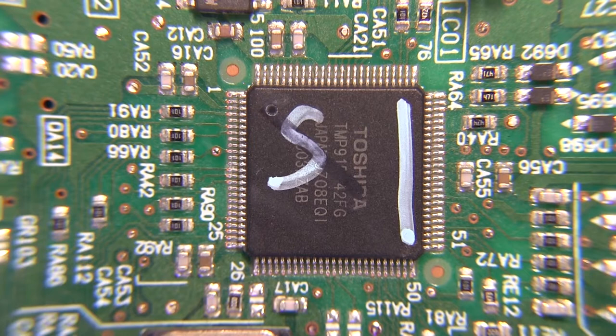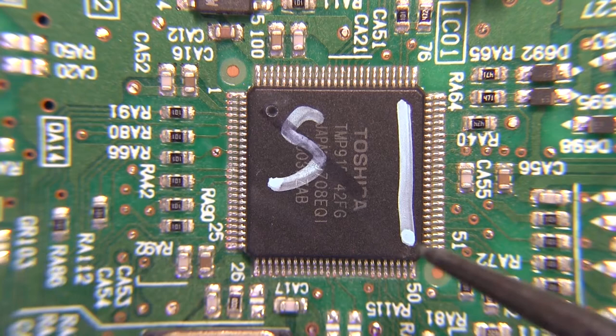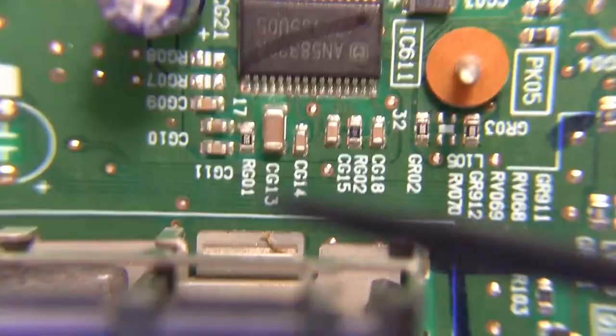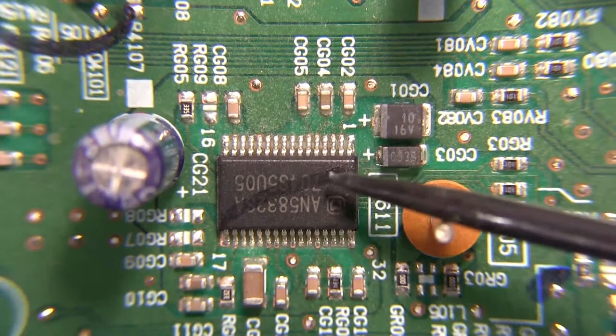I have a feeling it's probably also doing some of the on-screen controls, like for the menus — it might be generated by this. I'm not entirely sure how it's all put together. Moving over here, we've got this chip right here — this is an AN5832SA. I couldn't really find a specific name for it; it just says it's a silicon monolithic bipolar IC. But it looks like it's doing some of the audio decoding from the tuner. There's probably a signal that gets fed from the tuner, this does the audio decoding, and then it feeds it off into the rest of the audio circuitry.